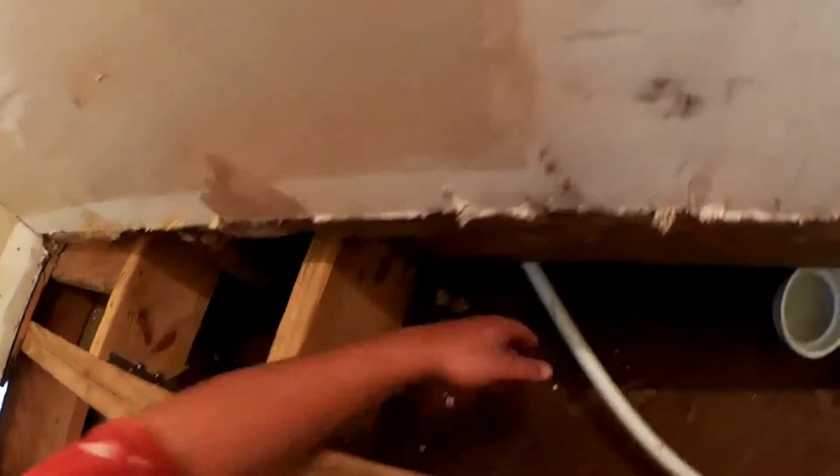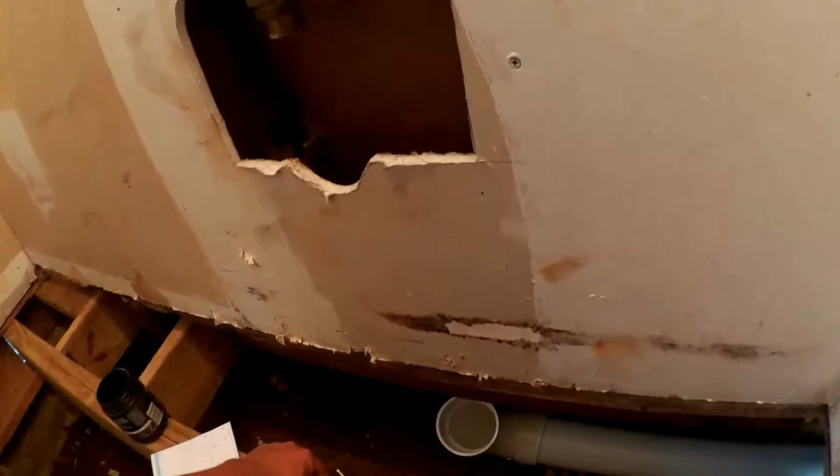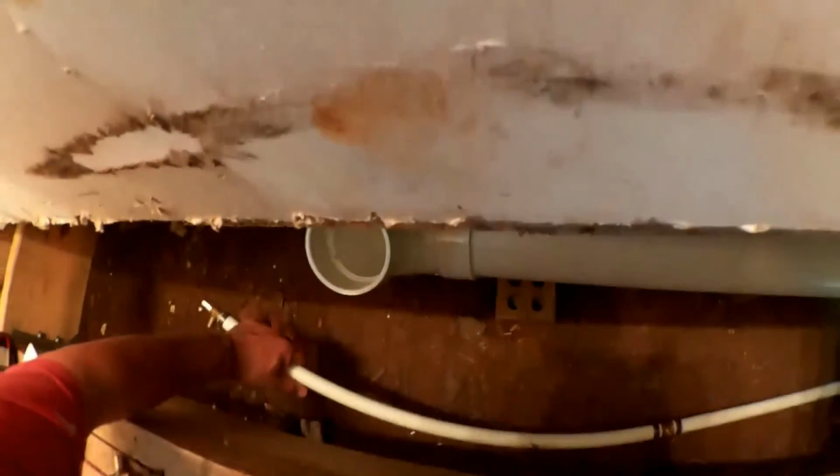Alright, and actually, let's have this water line turn the corner back here to be away from that outside wall with that uninsulated block. So we'll put the T for a toilet over here and go that way with the 1/2 inch. Okay, so we're going with a 36 inch vanity again. So at 18 we need the center. So our cold water line will want to come up right over here at 14. So we'll install our T accordingly, right about there. So there we go. Shower, sink, toilet, and on to the other end of the house.